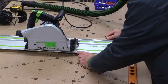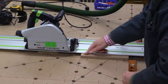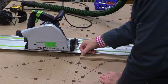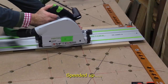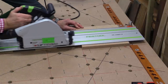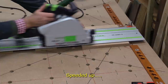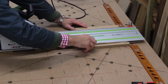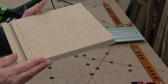The other aspect of setting the saw up is the ability to do the left and right cuts. The left-hand one is very easy — I just put my guide rail spot on that line and make a cut. The other one is slightly trickier: one needs to know the width of one's saw blade and then aim off by that amount. I can generally do that by eye. So I'm all set up — I'm going to do the left-hand cut first, then the right-hand cut, a slight smidgen over, and then the ones in between. And there is that other trenching cut done in stock that was too wide for the Capex.